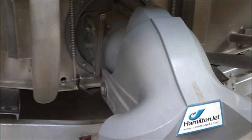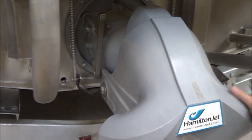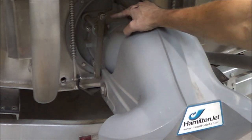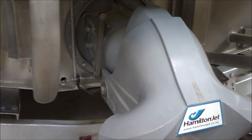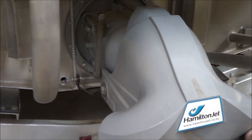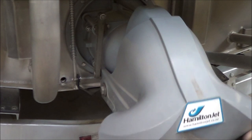Now I've moved it all the way to the bottom. So theoretically, without the brake box, the only thing keeping it in place is the cam over that's up here. But from our previous video, we know that that's really not cammed over far enough to keep this bucket down. Let's see what happens if I lift on it. See, it's moving there, but the bucket's not going anywhere.